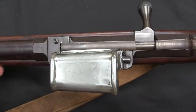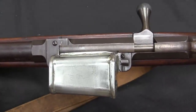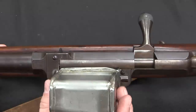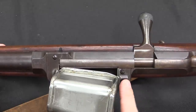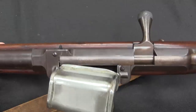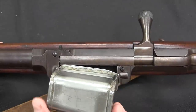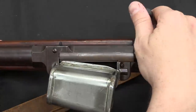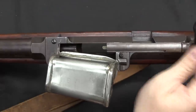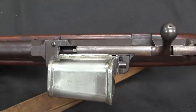I should also point out that with the advent of magazine rifles, the US military and many other militaries were concerned about ammunition expenditure, and they wanted magazine cut-offs. The Franklin does do that. The little spring detent right in here acts to hold the magazine in this position if you don't want to feed. Because it's offset, cartridges can't drop in. So here you can open and close the bolt and load single rounds one at a time. And then when you decide you do want to fire from the magazine, you just push that in.